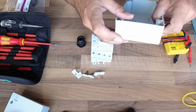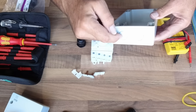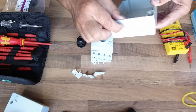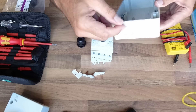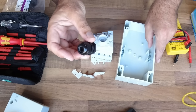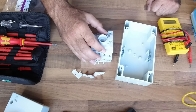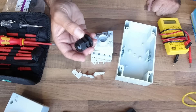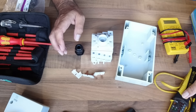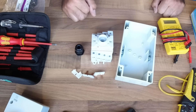I've seen quite a few people just punch these knockouts out and then pull their cables through with no glands at all, leaving a quite big open exposed hole. Some of these plastic edges are also quite sharp when you push these knockouts out, so there's a potential for that to cut through your cable as well. So it's really important that you use these plastic glands. I'll put some links in the description as I always do — links to this particular switch, links to these particular cable glands, and also a link to the simple little continuity tester I was using, which is a very handy tool for checking continuity and voltages during your installation.